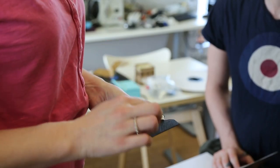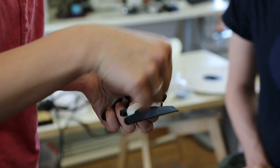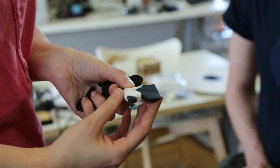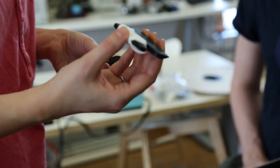But you can also really clearly see that the machine is printing, filling it up like this. So if the printer went like this, and you would rotate your object 45 degrees, it would print it nicely along with your object. So also placement on your bed will matter for the quality of your print.